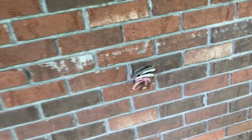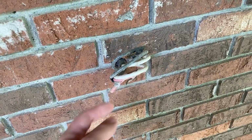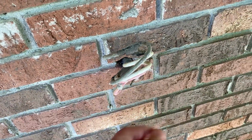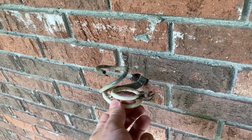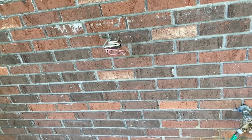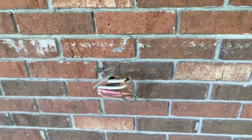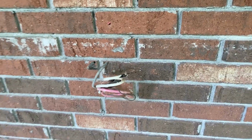On the back of our house here, one of the things that the inspector mentioned to me when we first moved in was that there was this wire hanging out here that was attached to nothing and it was live. They just had these wires taped off, and this was all live wire. So it's a four wire. I think this is hooked up to a 30 amp breaker on the inside. I don't know if it was set up for a hot tub or maybe they used to have an air conditioner back here. I don't know what was back here, but they basically just capped it off and left it sit here. That works out really well for us because we need a 220 volt four wire hookup to hook the generator up and run our panel.